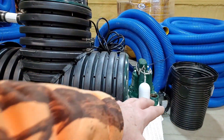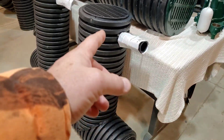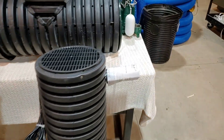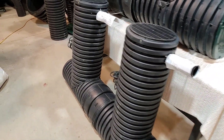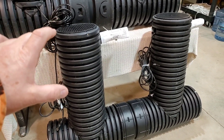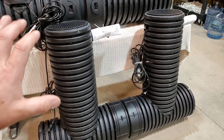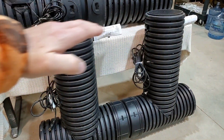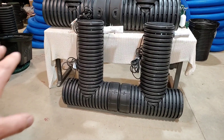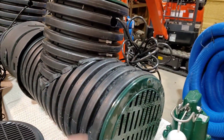If you know you're going to end up 24 inches deep on your trench, you need to go to a 36-inch duplex. This is our micro Bad Seed in 36 inches — our newest micro. If you're 24 inches deep with your trench, this unit will be 12 inches deeper when fully buried. The water falls into the sump pit, turns on the pumps inside, and leaves your 24-inch trench dry as a bone. That's what you want — no tree roots filling in your trench.